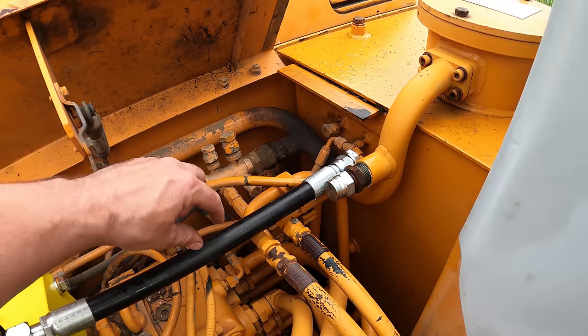That's obviously really low. That's because I turned down the relief valve on that one-way valve and I never turned it back up. So let's turn that back up first. So that seems like it hit the new relief valve now. It's about, what, 1800? It's pretty far away, I couldn't really see it, but it is leaking down. But there's also air in the lines right now. I could instantly tell that it was using the new relief valve because it makes a different noise now. You can see that that return hose is being flexed.